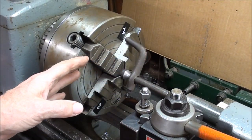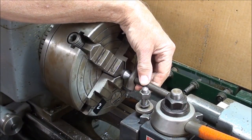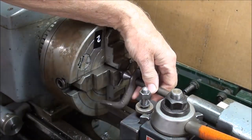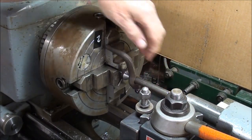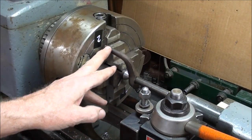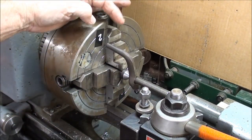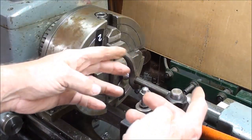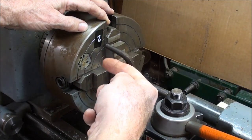After the first thread is complete to our satisfaction, it can be taken out — but do not change anything else on the setup. It can be taken out, rotated, and put into position to cut the second thread. The dog tail must be up against the jaw. It will quickly assume that position as you start to cut, but make sure you're up against it so you don't get a false start and a bad thread at the beginning. That is what I think is a good alternative to the first method, where I had to move the tool half of the lead using a dial indicator.